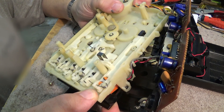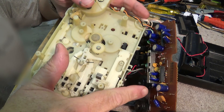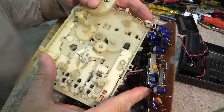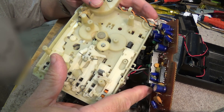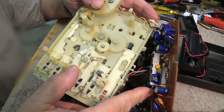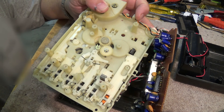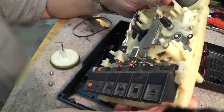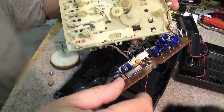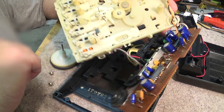This last one is the record lever. When you press the record button down, in addition to pushing down the play lever, there's a little metal spring clip mounted on it that presses this switch over here — this is the record/play switch. When the switch is in its normal rested position, it's in playback mode. When it switches, it basically switches the amplifiers around: instead of connecting the output of the amplifier to the speaker, it connects it to the record/play head, and the input to the amplifier is connected to the microphone. It also turns on the erase head, which is just an electromagnet. This is a DC bias system — there are no bias amplifiers or oscillators, just two ICs doing basic DC recording. Very simple mechanism.